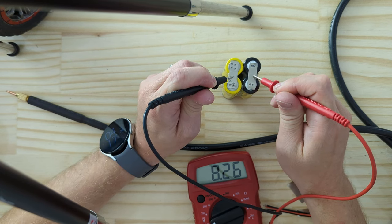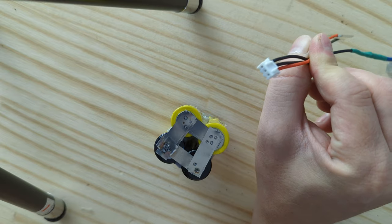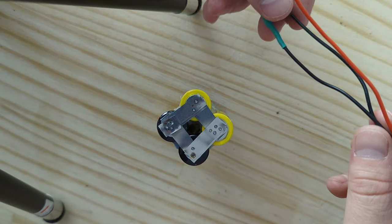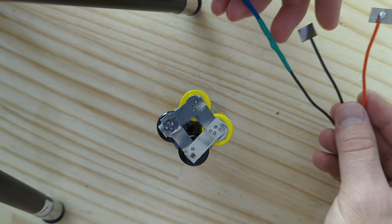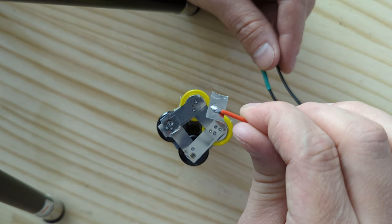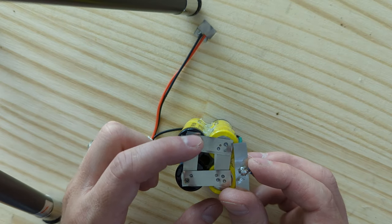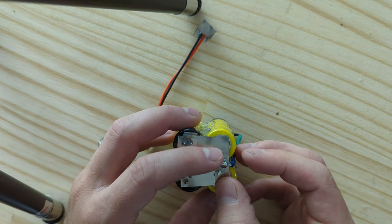Let's check the voltage — 8.26 volts. The next step is to connect the balance wire. This is a 2S balance wire for a 2S battery pack. Normally you solder these onto three points: one right between where the series connection is, and the other two on the battery pack's positive and negative. I've gone ahead and soldered the balance wire onto a piece of nickel strip outside the battery pack so I don't put a lot of heat from the soldering iron into the cells, and then I'll spot weld those where needed.